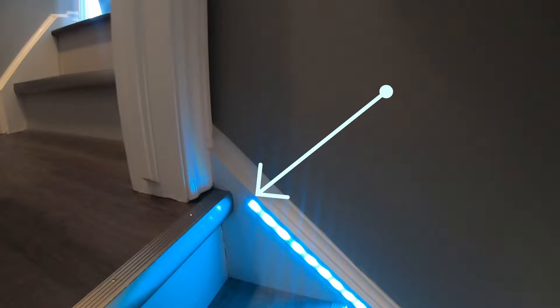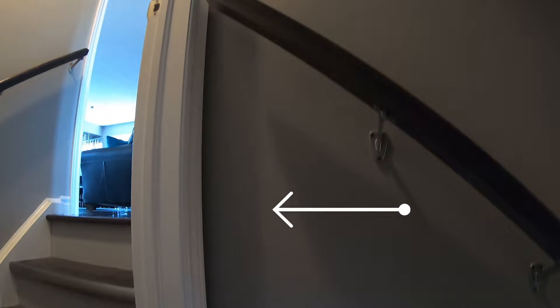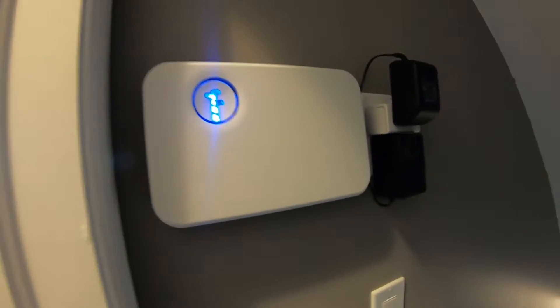For the wiring, I knew the wire going to the LED strip light would be fed through the stringer in order to hide the wires from being seen. This means the wire runs into the wall cavity above, behind the drywall, and I would have to fish the wire to some location where I can have a 12-volt adapter power the lights with a 120-volt receptacle close by.